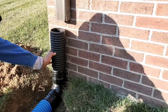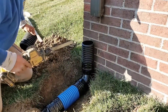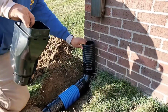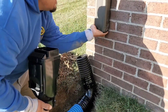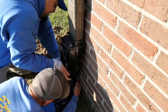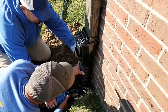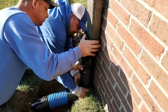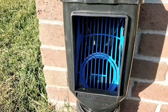The 3-inch line will either go over top of the sprinkler pipes or just beneath them. You're going to be able to dig a lot shallower to accomplish the same thing. As long as you're catching the leaves and you have a nice clean-out leaf filter so you're not trying to fill that 3-inch pipe full of pine cones, big leaves, and twigs that fall on the roof, you'll be fine. That's what the 4-inch pipe was all about — it was one-size-fits-all and you could float all that big trash through it. With 3-inch, just have something to catch those really big organic materials that build up in pipes and cause clogging. You can see we've got two guys here handling this 4-inch pipe to get everything in place — if it was 3-inch, you wouldn't need a second set of hands.